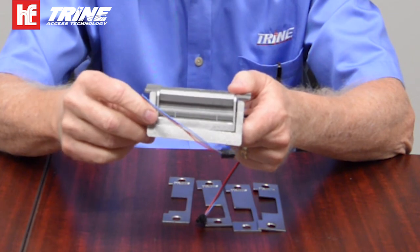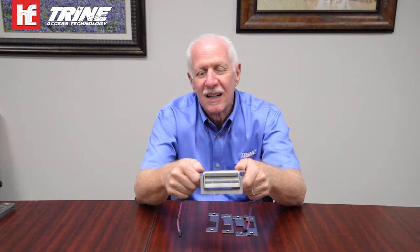We do one-box solutions, so in the box we include four face plates and a trim skirt. The depth of cut on this strike is only one and three-eighths of an inch, so if you're replacing a competitor's strike with a depth of cut up to one and thirteen-sixteenths of an inch, this trim skirt slides neatly over the strike and will hide a competitor's larger cutout, as well as a cutout that's been done in the field.